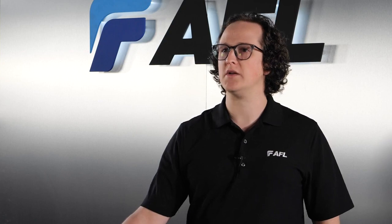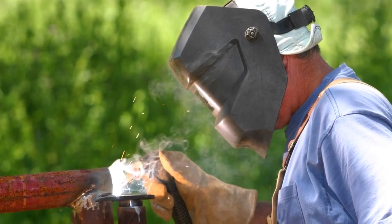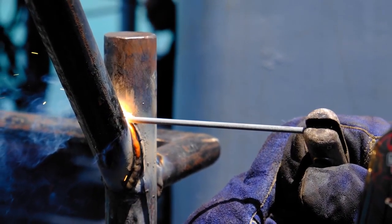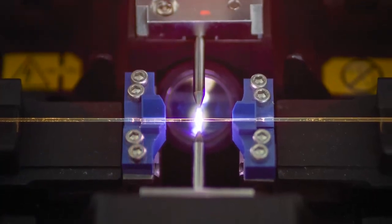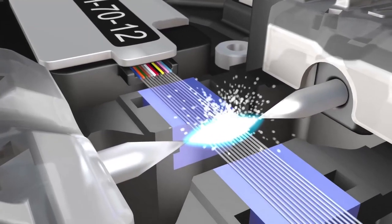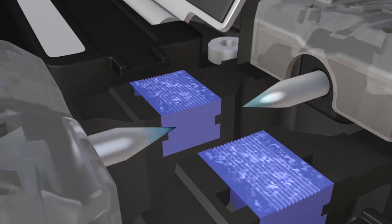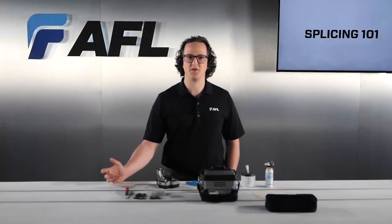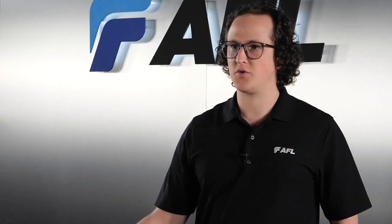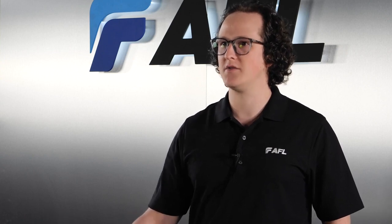It's a lot like arc welding. Not exactly, but similar. Most forms of welding use a filler rod or wire to bridge the gap between the parts being joined. Fusion splicing, on the other hand, uses an electrical arc to heat the two optical fibers above melting point to soften the two glass ends. Then, precision electric motors, guided by image processing, push the melted fiber ends together. The arc continues until the fibers have melted together sufficiently to form a strong splice. All in all, the joining process takes only a few seconds and produces a splice with low optical power loss.